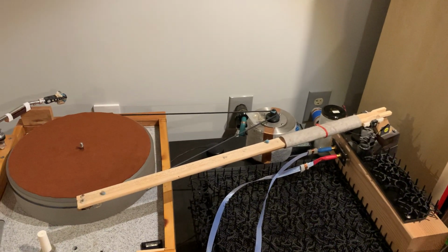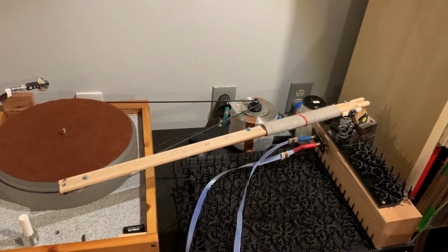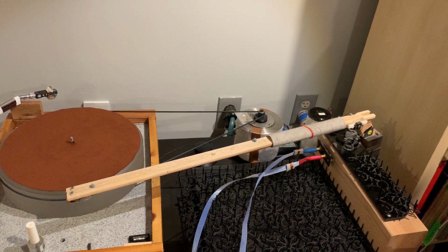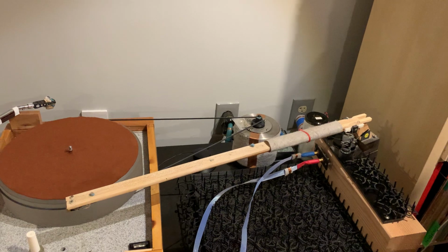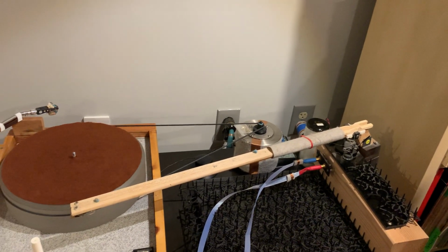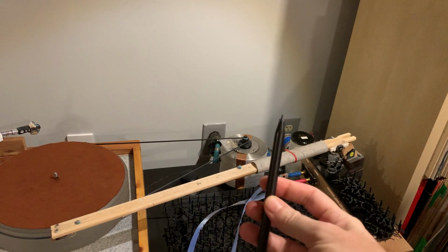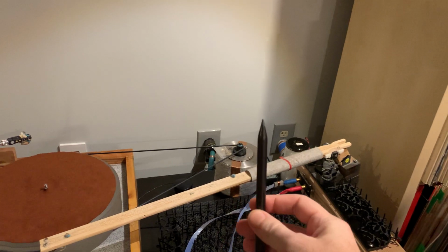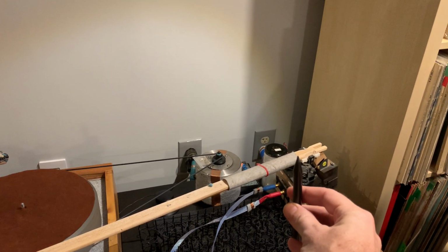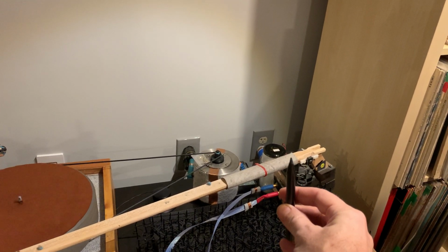arms, and it's a much higher grade solution, and that's a unipivot graphite bearing suspension, and that sounds like really high-tech and very fancy, however it's the cheapest, easiest way to do. You just grab a pencil. This is not a pencil, but a pencil just looks something like this, and you stick it under the arm, and that's where it pivots on, and then you are good.